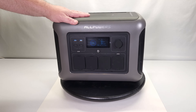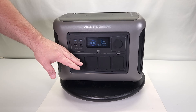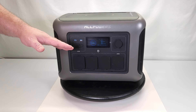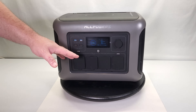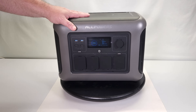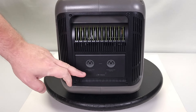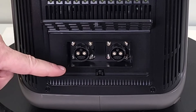There are four 120-volt 1800-watt AC outlets. This is an 1800-watt device — it'll power up to 1800 watts at 120 volts, which is 15 amps. Combined total you can get 15 amps out of these outlets. That's exactly what you get from a standard home wall outlet on a 15-amp breaker, so this should theoretically power anything that can be plugged into a home wall outlet.